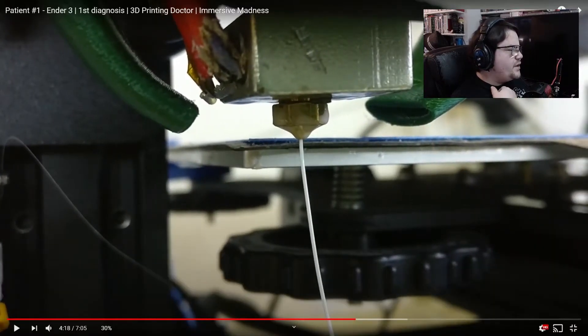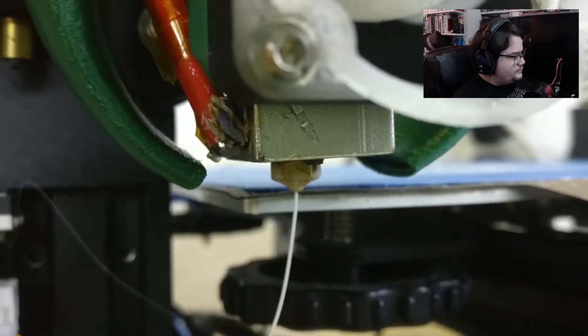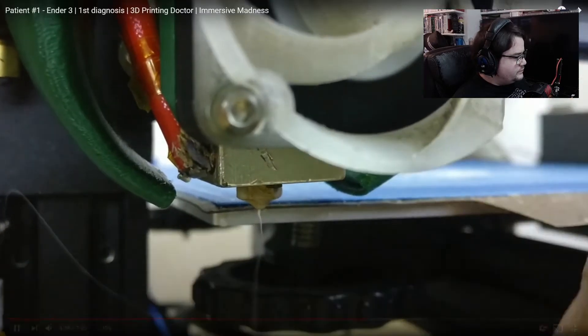One thing I did notice — I can't tell for sure, but usually around the hot end part you have some sort of insulation. That stops the heat escaping and keeps the heat where you want it, warming up your filament. I can't see any sort of insulation around that. Being it's a TH3D style, I'm pretty sure they provide a silicone sock with it. That's a replacement because normally it comes with some ceramic material that wraps around it, but that'll come off if you change your nozzle a couple of times — there's no way of stopping it. Maybe check for a silicone sock. Although, it does look like there might be something on there — Andre, confirm.